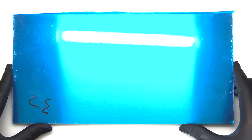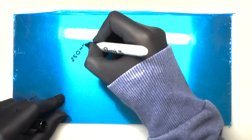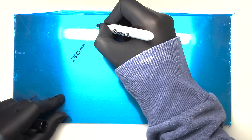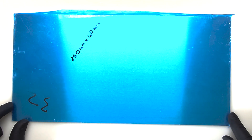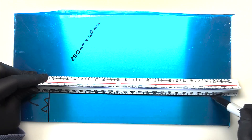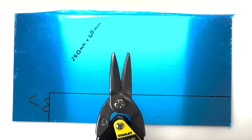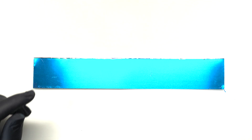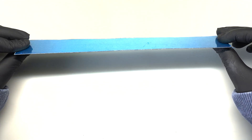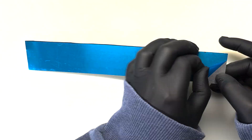Let's cut the plate to size first. You're going to need a sheet of aluminium that's 0.5mm thick — I'll have all the materials and tools in the description below. Our plate needs to be 250mm long and 40mm wide, which is just slightly smaller than the battery. We can mark that out on the plate using a sharpie and ruler from the edge. Now we can cut along the lines we made. I use these cheap metal shears from Amazon — they make it really easy to cut the plate, but you can use any method you want. It should look something like this when you're done. Bend it flat if it got out of shape while cutting. The edges don't need to be completely smooth, but if your cutting method leaves jagged edges it may be worth sanding them down. Once we take off the plastic film, it's ready to stick to the battery.